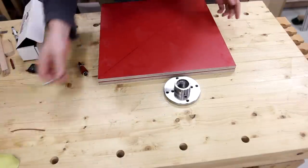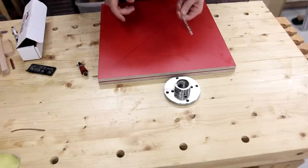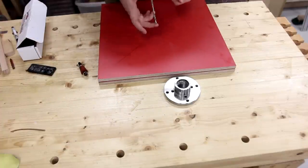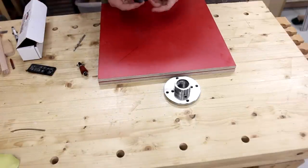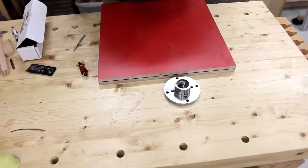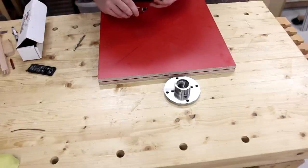From a tooling standpoint, I'm going to use my bandsaw and my circle-cutting jig, which means I'll need to use a 5mm drill bit to create the pilot hole. For the grooves we're going to need a router with a quarter-inch bit to match the quarter-inch bolts.